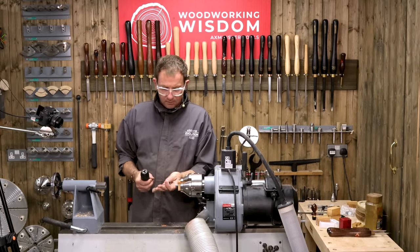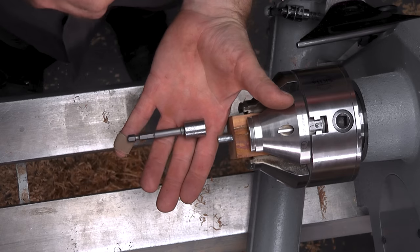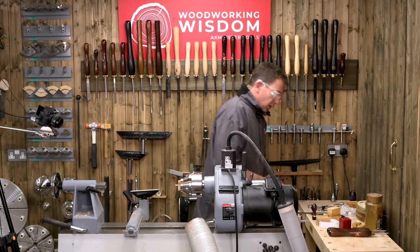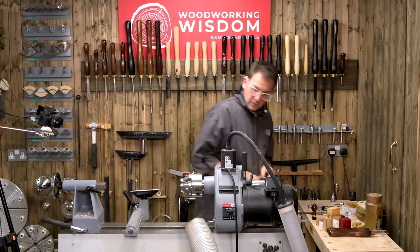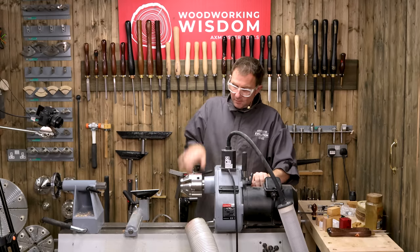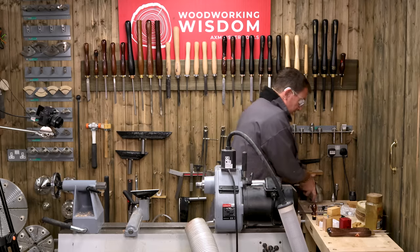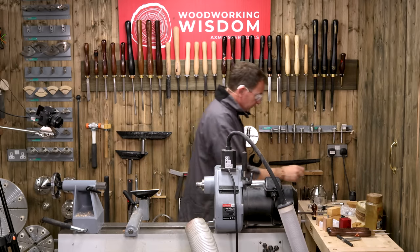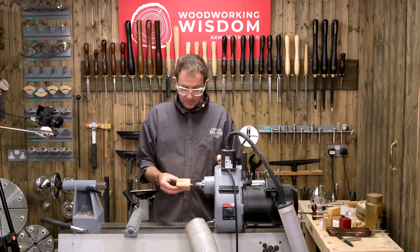That's a godsend. Something to hold that, push it up, feed it in. Again, you can use the tailstock, as we said, just to gently feed up. So, move that out of the way. Chuck key, we want the bit of wood out. Chuck's got to come off. If you were doing a batch of these, I'd do, however many I do, in batches of 20. Quite easy to do. We then need some way of holding the bit of wood, the blank, on the lathe.